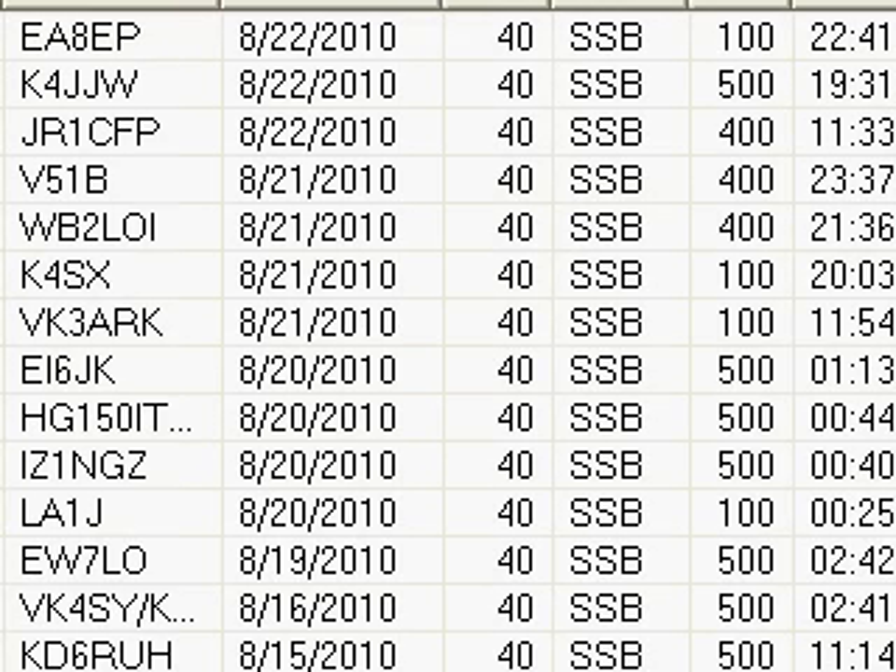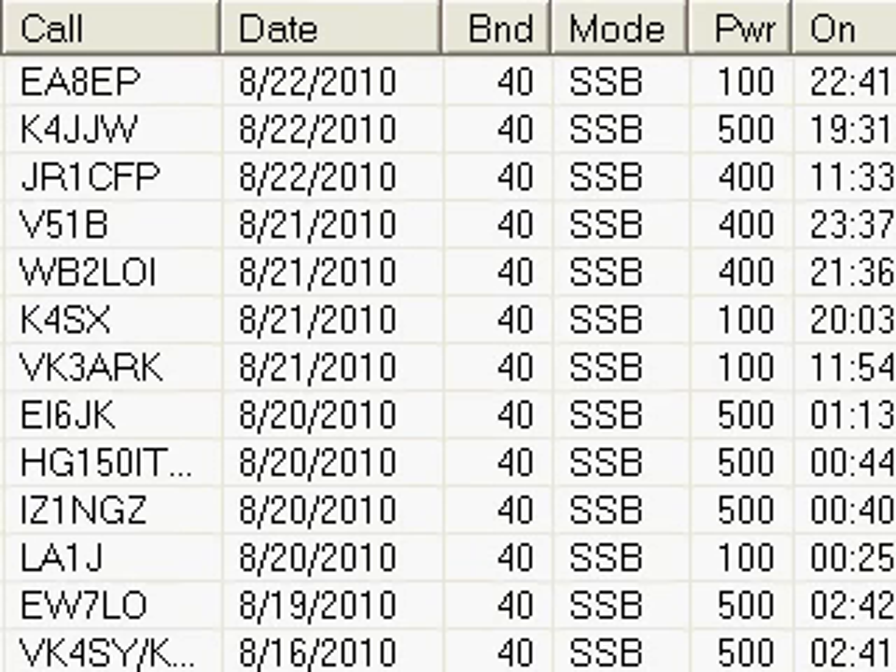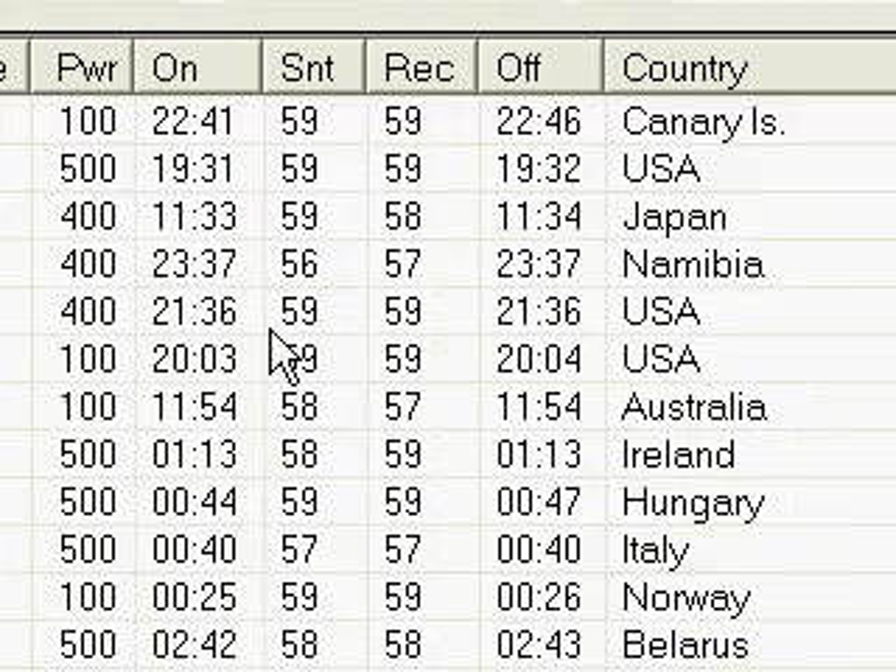KQ8RP here. Just want to show you the performance I've been seeing with the pair of 40 meter verticals. I just had this up about the last couple weeks. I put 500 more feet down of radials on 821 and 822, basically, and had 22 underneath it to begin with. I put another 16 down this weekend. It's made a world of difference.